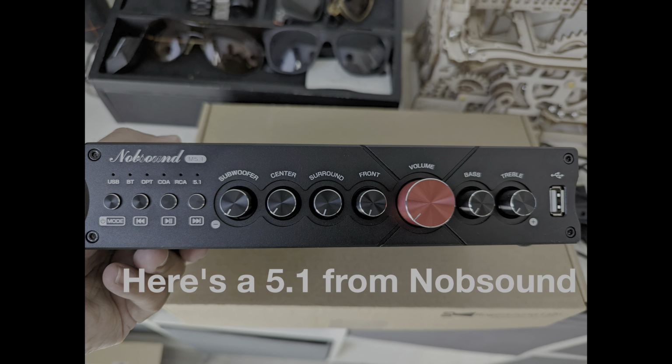And I do have a recommendation for Fosi, and that is, I wish that they would make some nice 5, 7, 9, 11, 13 channel Class D amps, because Class D is efficient. It's power efficient, right? So to get the amount of power that we need here, it's going to take less power than an equivalent Class AB, or definitely more efficient than a Class A amp. What I think that a lot of people don't realize is, if you're using a sub, if you're not running speakers full range, for example, in a home theater situation, you're probably not using a ton of power, right? You're probably using a lot less than you think. So I think if they came out with some smaller amps that were, let's say, 60 clean watts, I think that a lot of people could make use of that. Something very slim, streamlined, where you can buy a couple of them. I think that would be a great idea specifically for home theater situations.